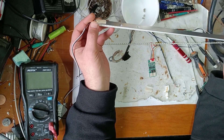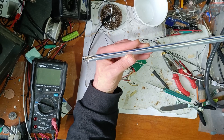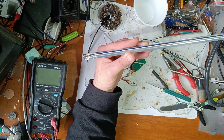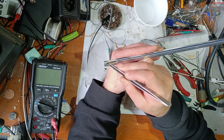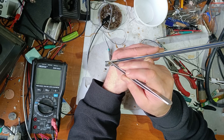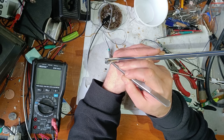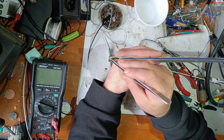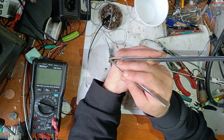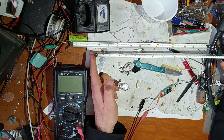I needed to find a way to glue the LED strip to the aluminum part so the LEDs don't overheat. While doing this, I found the problem: one connection was not welded, and that's why it entered open lamp protection. That was the cause all along. But I'm going to replace it with the LED strip anyway, so I've attached it with hot glue.